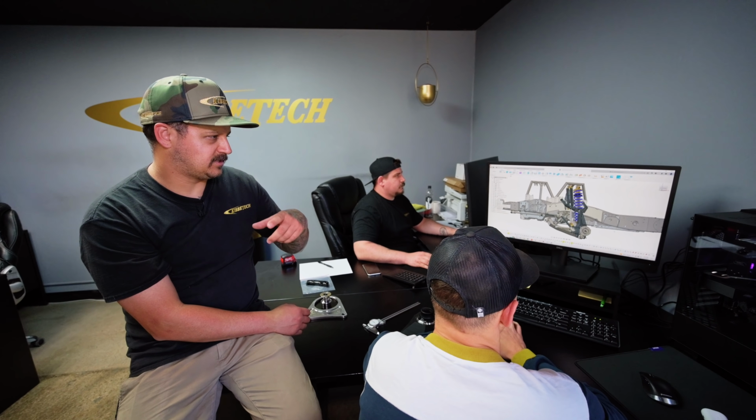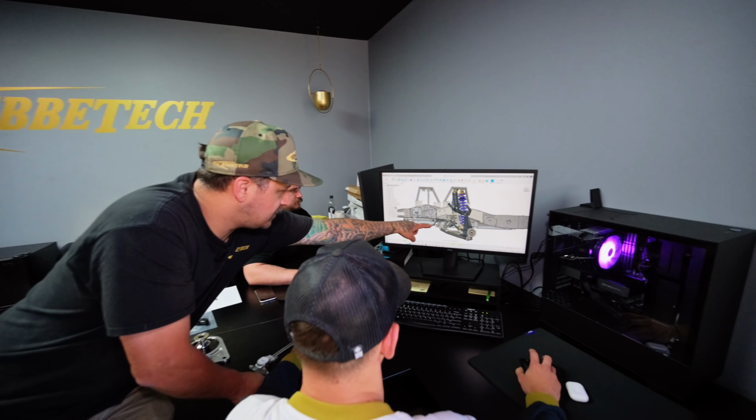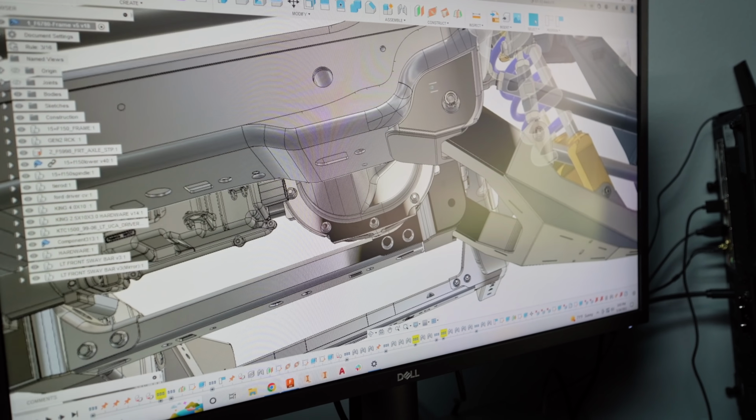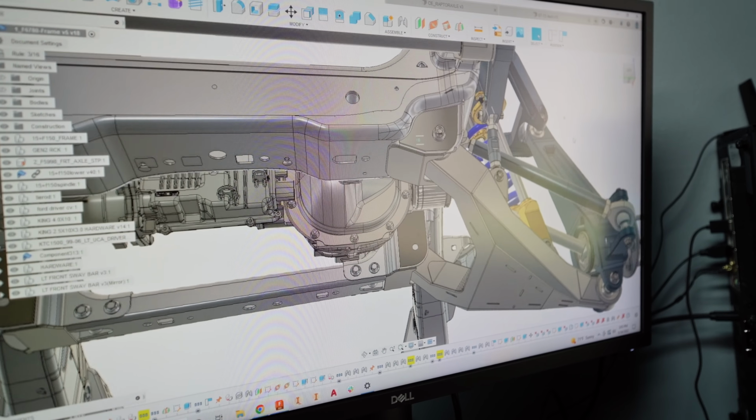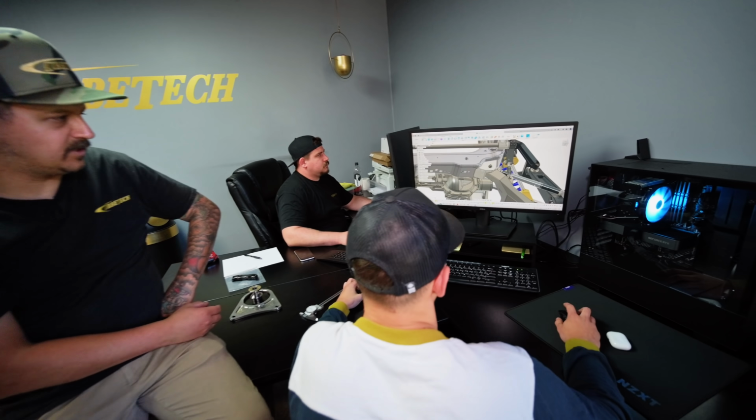And then we're gonna run the RCV axles, front billet spline sway bar. On these pockets down here, we actually cut away the stock pocket because those things always catch the ground and they fold under into your arm. And then we'll have this little box end plate for the bottom, to keep those pivots from smashing in on the A-arm.